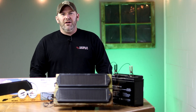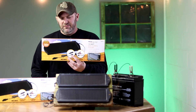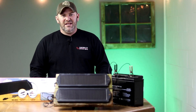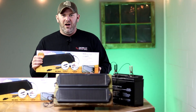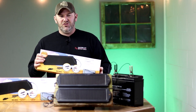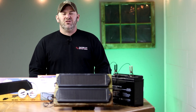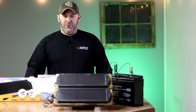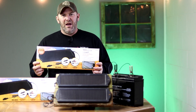I'm going to show you now how I do this. I've been using the Thunderbolt 1.5 watt solar panels and I usually buy a pair of them. I've found that two seems to be the right number — two 1.5 watt solar panels have been more than enough and not too much that it overcharges and damages your battery. I do not run any solar controller at all. I simply hook these two panels up through a diode and hook it directly to the battery.